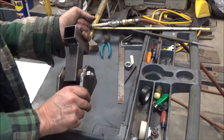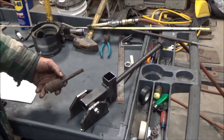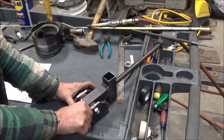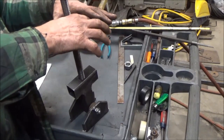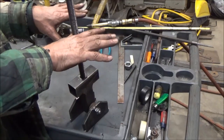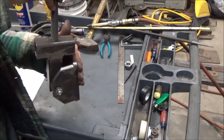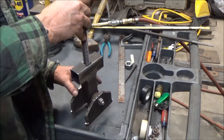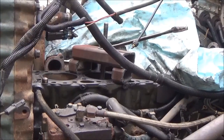I got it all assembled here. I put four washers on each side — I don't know how many I'm going to need until the cylinders arrive, or until it gets above freezing so I can go out and drop it down in a cylinder and see. I've got a stack of washers here so if I need more to spread it out and make it a tighter fit I can do that. The only thing I haven't done is on the top — I just need to get another bar of steel, put a hole in it so this will go through, and block that up on either side of the cylinder on top of two same-sized blocks. I'm going to raise these things up, drop it down in the cylinder until they fall out the bottom, then pull it back up and start tightening it down.